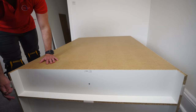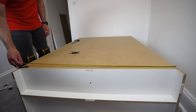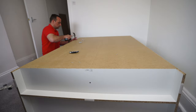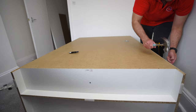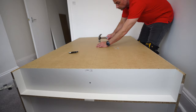Close it right on the edges — on the sides, top, and bottom panel. Now measure corner to corner; you should get exactly the same number on both sides. If not, tap one corner until you do — that means the wardrobe is at 90 degrees. When you start fixing with nails, check that the top, bottom, and middle have the exact same measurements, as sometimes they bend and you need to twist or straighten the panel.